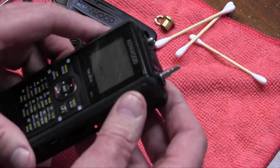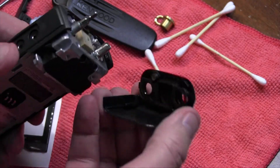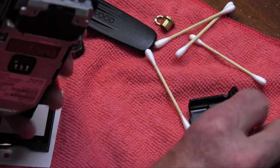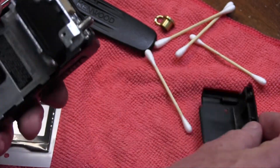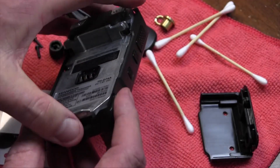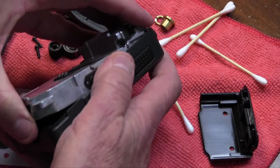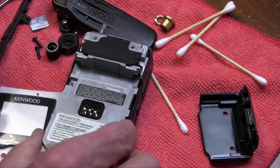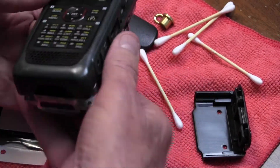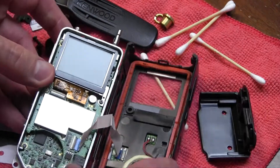Next, take off the top cover — there's a water seal there. Here's the GPS engine. Sometimes this little grommet will stick on there; just pull that off. Then, carefully pull out from the bottom the radio chassis. Be real careful that you don't yank it apart because there's a ribbon cable. When you pull it out, turn it over just like that — there's a ribbon cable right there.